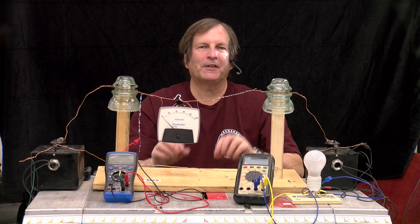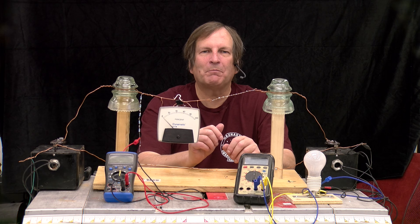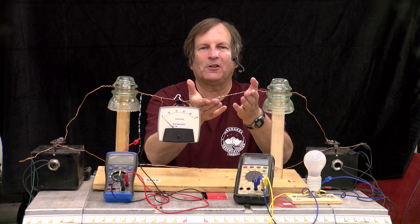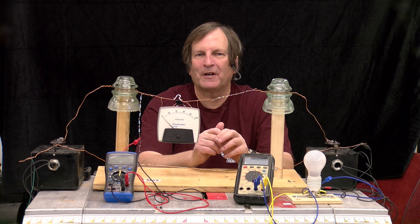The thought I had was that the problem might be the fact that the whole voltmeter's potential is now around 10 kilovolts above ground. From previous videos, when you have potentials like that, you start getting corona discharges — meaning electricity is escaping from the wires or points in the circuit, particularly through every sharp point, and spewing out into the air. If that could happen in a very high-impedance, highly sensitive circuit inside the voltmeter, well, that might cause it to produce erroneous readings.